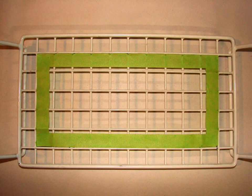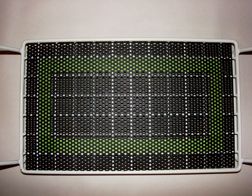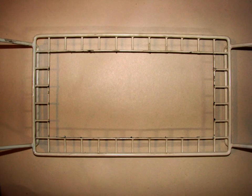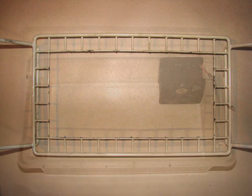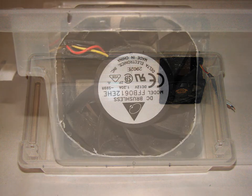I started by flipping over the space saver tray and folding the legs out to make wings at about a 45-degree angle where the lights will go. You can see in the center where I've marked dots for the cutout, centered over the vacuum tray underneath. I marked it in green so you can see better. You can put the punched metal on top — you can get punched metal at any industrial catalog shop. It has about eighth-inch holes and you can put screws in those to pull it down against the plate, which is really nice.